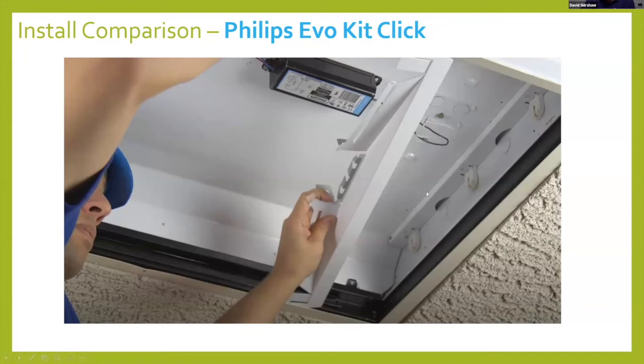So the wires are snipped. You don't see any wires going to those sockets, so they're probably snipped and kind of tucked in that cavity there. But he's chosen to leave the sockets in place. Same goes with the fluorescent ballast. So here's that old fluorescent ballast, and the term I've seen some electricians use is entombed in place. So again, the wires are snipped to that ballast, but you're leaving that ballast in place, and these DoorStyle retrofit kits will fit up in that fixture, and there's enough space. They're thin enough, small enough to fit in with both the sockets and the ballast, typically still in place.